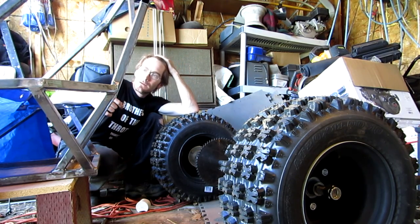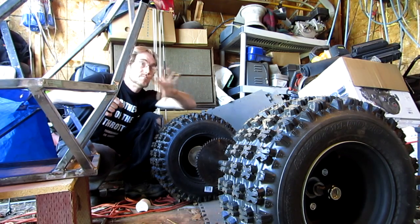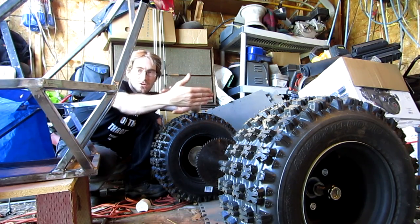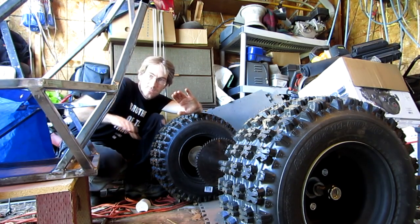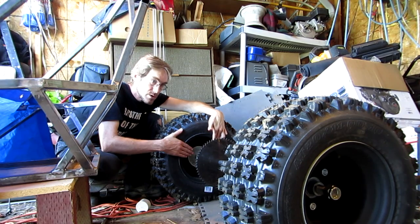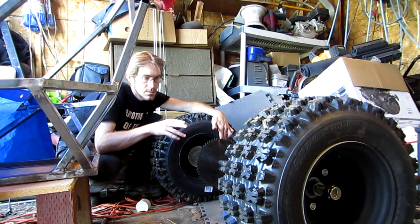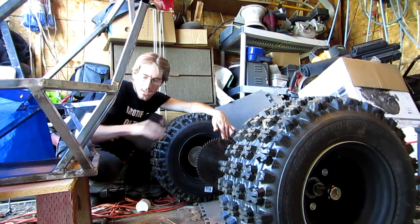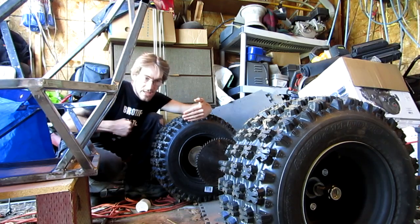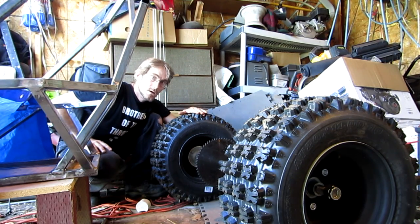I've got to play around with it in the CAD first and see how I'm going to be able to do this and how easy it's going to be. It's going to be a little difficult with all these angular cuts and building off this whole chassis. I probably could just make the engine chassis shorter, line up these bars, and then come down here and build off extensions on the actual rear swing arm so they come in closer contact with the tires. That way I don't have to worry about bending my axle if I ever hit anything really hard. The wider I have my frame, the less chance that'll happen.